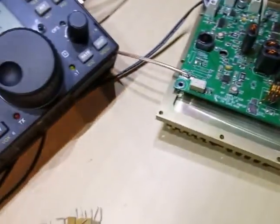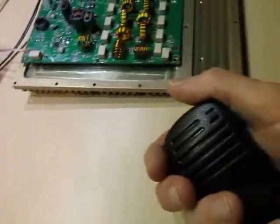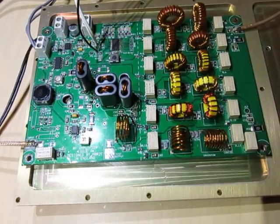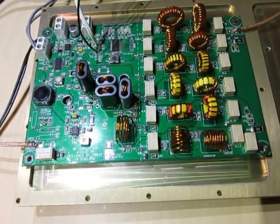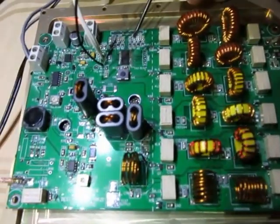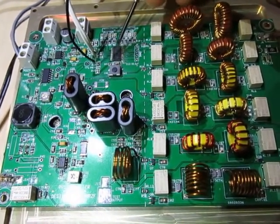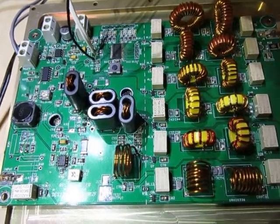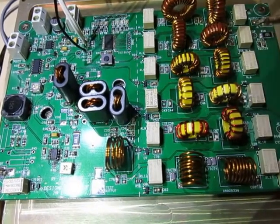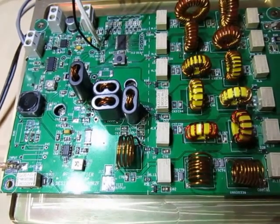If I go to transmit, you'll notice this is connected up to the KX3 radio and I've got the mic here. If I press the transmit button the LEDs flash up and then release. What that's done is it's written the temperature reading into the calibration memory inside the microcontroller right there. The micro has got its own temperature measurement, and it's also got two little diodes that sit underneath there that also measure the temperature. It does a little calculation — if the thing overheats then it knows about it and does something about it.